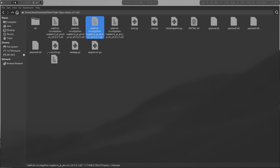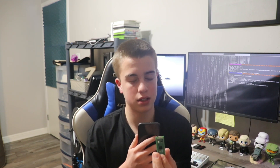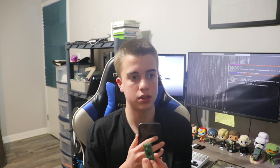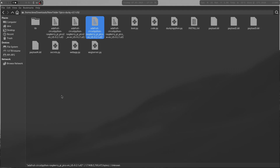Take the UF2 ending in 'pico' and drag it onto your Pico. Important: if your Raspberry Pi Pico is not properly factory reset, you're going to have issues copying files because it'll run out of storage. You need to wipe it using a tool like Pico Utils, or on the forums there's a UF2 bomb you can use to clear it.